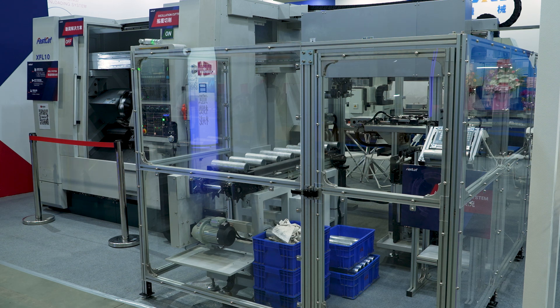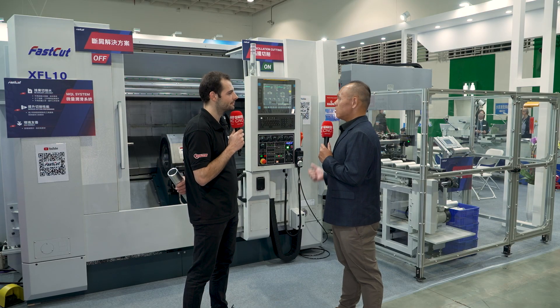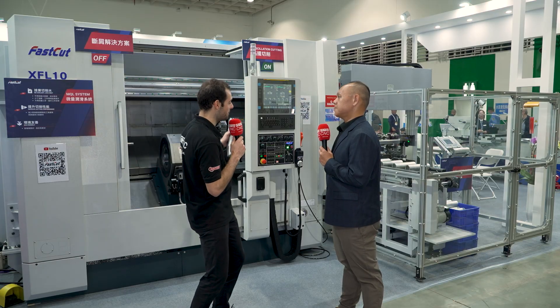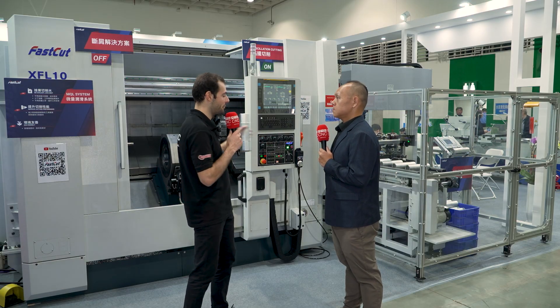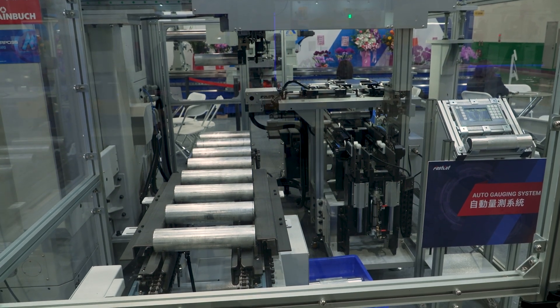With 20 years of experience working with customers on high-volume parts, how do they get the best out of the machine? We really try to get involved with the customer when they start building the line. We look at the takt time they expect, design special tooling to save tool-changing time, and design the loading system to match their flow requirements — for example, parts coming in from the left and flowing out on the right. We build a customized infeed conveyor for them, and for the gantry we try to run it as fast as possible.